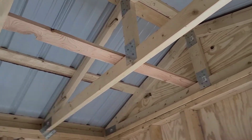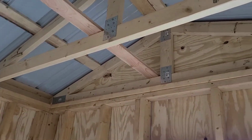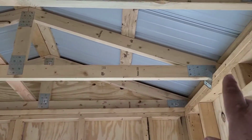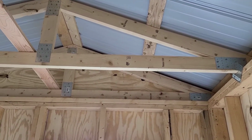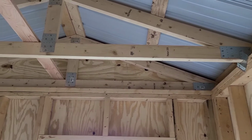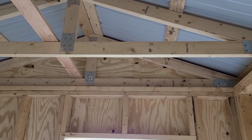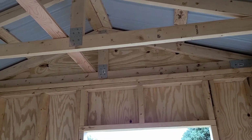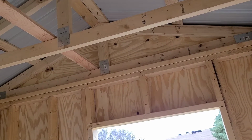And that just ties all of our ceiling joists together and keeps them from moving around and keeps them on the correct spacing. Now, if we had a lot wider rafters, we would need more of these rat runs every now and then. So if we were at a 10-foot wide building, we may want to put 2, or say you got a 20-foot wide building, you'd put one every 4 or 5 feet, and so on and so on.